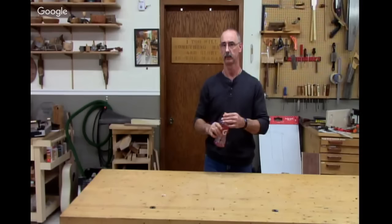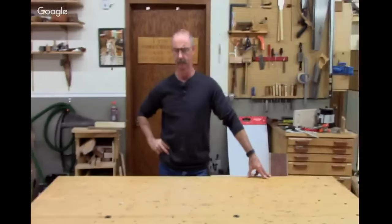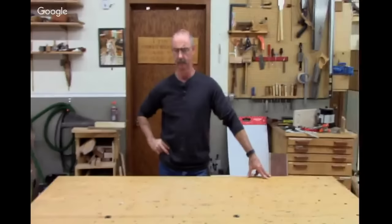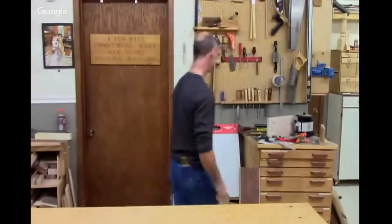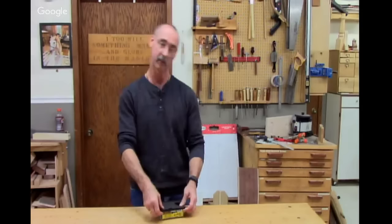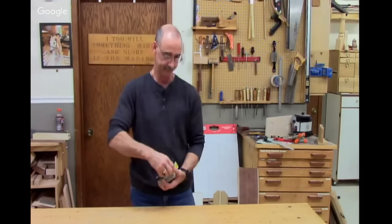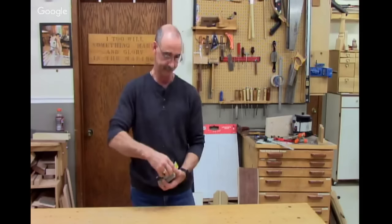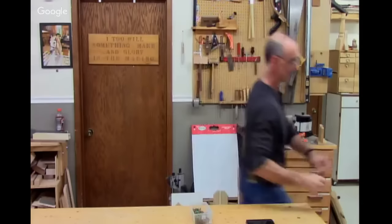Chris has been watching videos about dumping drywall screws for woodworking and only using wood screws that have a shank. Drywall screws are not woodworking screws — woodworking screws are woodworking screws. What we don't want when putting stuff together is a screw like a drywall screw that's fully threaded from the tip to the bottom of the head. The threads on a drywall screw are very fine and it's threaded from tip to head — the problem is these threads have a tendency to make it difficult to pull parts together.